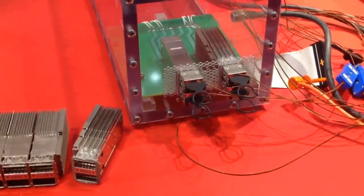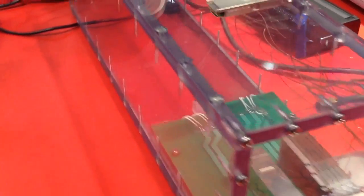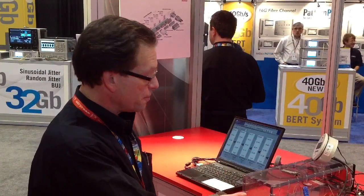We're demonstrating this functionality by using a wind tunnel with a standard 2x1 ZQSFP adjacent to a 2x1 ZQSFP equipped with the TMC. We have modules assembled into the connectors. We use a power supply to put a 3.5 watt load on each module.